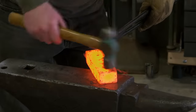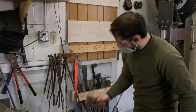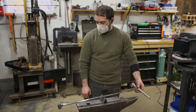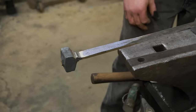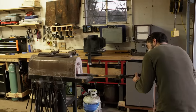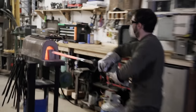So now I'm working on the hammerhead billet. Everything else is solid underneath. Now I'm going to take these two billets down to the grinder and just floor them out and lose some weight. I decided I'm going to harden and heat treat the handle of the hammer before I join the head to it. It's so long and skinny, I'm worried about it bending during the test. Pray nothing warps. If it twists or warps or bends, there's not much steel to take away to straighten it back out afterwards.